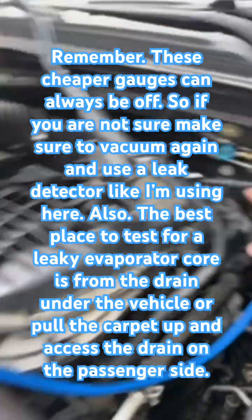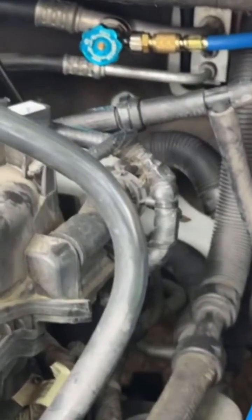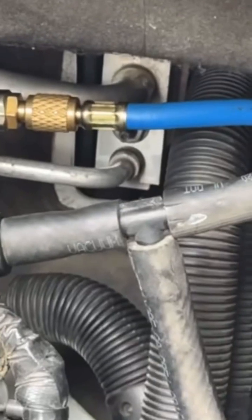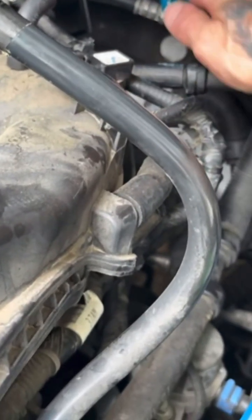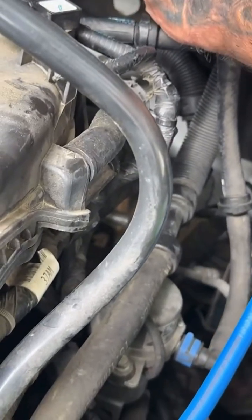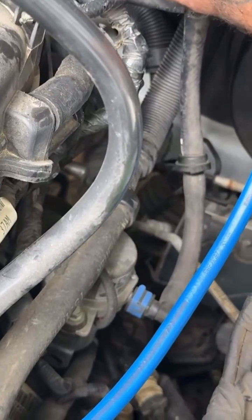Then you're going to use your Pittsburgh pump after everything's hooked up. You're going to start your 2.5 CFM Pittsburgh unit running 120 volts — it's a basic but effective pump from Harbor Freight. Works great for what you need it to do. Once everything's tight, you open both the low and high valves on the manifold and let the vacuum pump run.